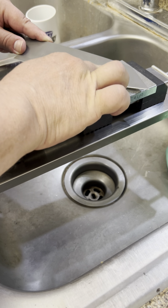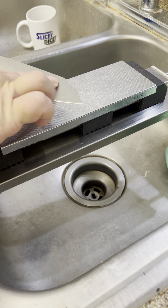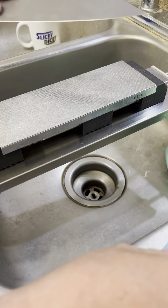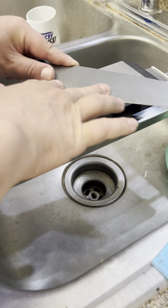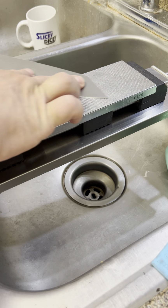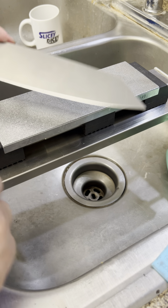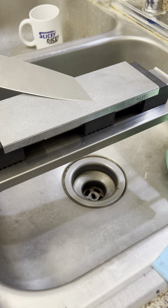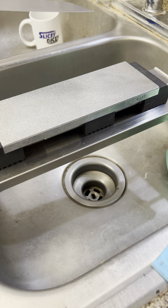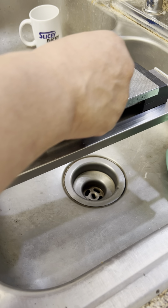Good. So that's it. I want a little bit of focus on the tip. That was an awful lot on this side. The other thing about running lengthwise when you have to do the tip is you don't run the risk of over sharpening the tip or dragging it, as some people may call it, where you lean it back and drag the tip or run it too long and it over curves. If you're running down the length, it will, but it takes a lot more of it.